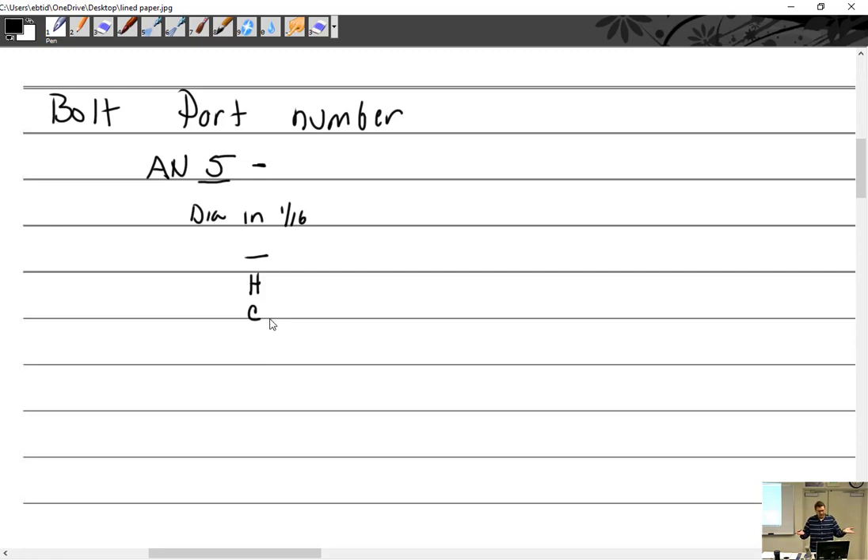Follow me? It's got to be dash or C. So I could have a 5C6 — that's five-sixteenths inch diameter, corrosion resistant steel, six-eighths long, so three-quarters of an inch. Or I could have a 5H6, which means it's five-sixteenths with a drilled head and six-eighths long. Or if I want corrosion resistant with a drilled head, that'd be 5CH — that's the only time you'd really see two letters together: CH, corrosion resistant drilled head.